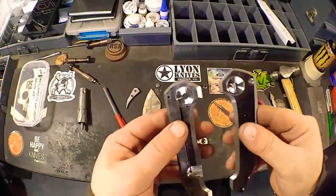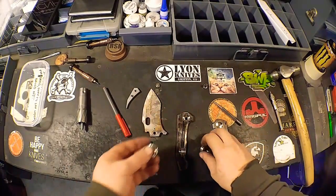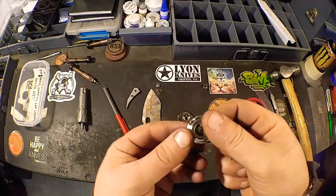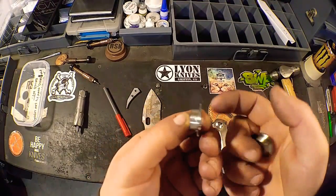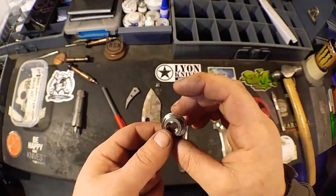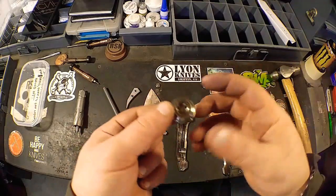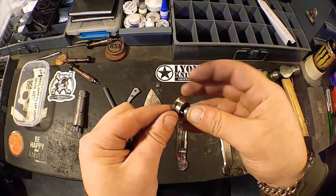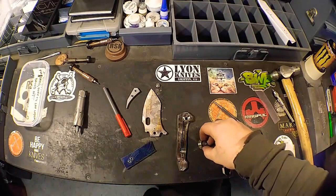Welcome back. We got our center bores all done for our pivot collars, and our pivot collar blanks made. Now when they come off of the mill after I cut them with the hole saw, they've got this flange of extra material on them. So from this point I'm going to take them over to the grinder and grind all this off until it's flush. Basically a collar is a cup that the pivot can sit down in, and that's it. So we're just making a cup.